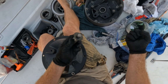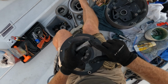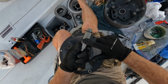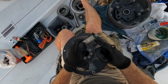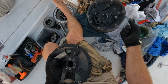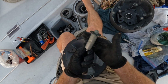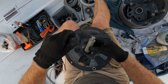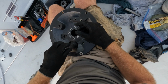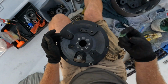How much grease goes in these things? If you're doing it with me, a lot of grease goes in them. Most of the ways that these winches get damaged over time is by having to do jobs where you're trying to smash them apart, trying to get the pegs out. I've had it where we can't get the pegs, different design of winch where things are actually kind of made into the bottom of the winch. We've had to drill up through the deck to gain access to then put a punch on the bottom of the pillars and get them back out of tricky situations where they're jammed in. So we want lots and lots of grease. Grease can also be applied in areas like this.